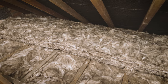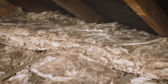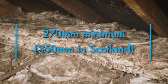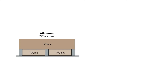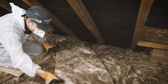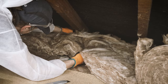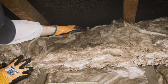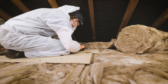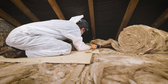To complete your loft insulation, you need at least one more layer laid at 90 degrees to the first layer. The total depth of insulation should be at least 270mm, or 350mm in Scotland. The thicker this second layer, or the more layers you add, the more energy you'll save. Again, start at the eaves, cutting notches in the insulation so it sits snugly round each rafter. Be sure to maintain the 50mm air gap at the eaves for this second layer too. If space at the eaves is limited, you may need to start with a 100mm roll, laying 200mm next to it as the roof height increases.